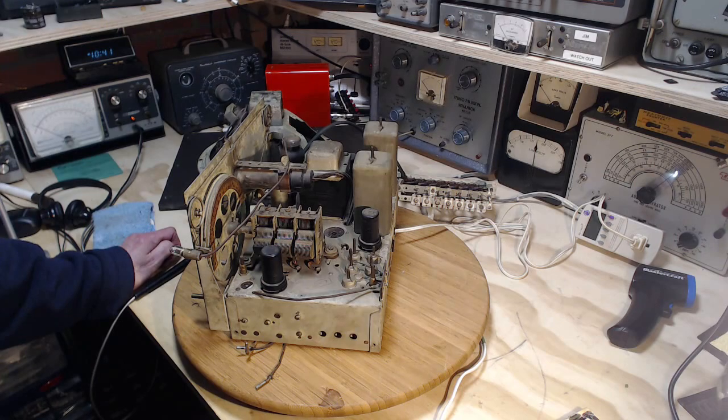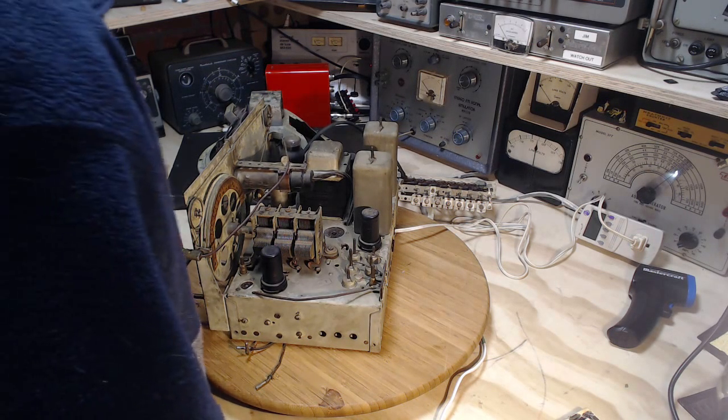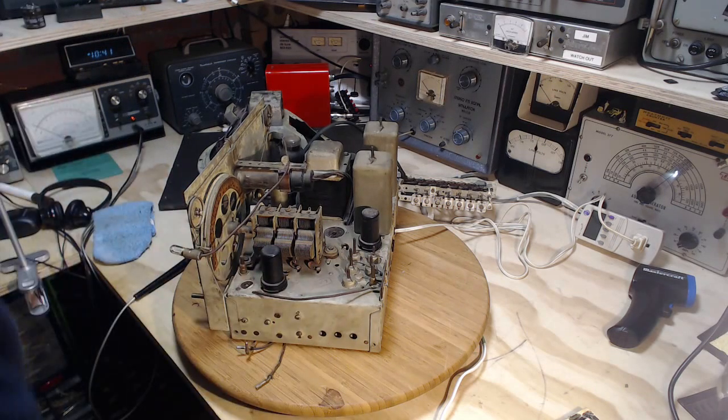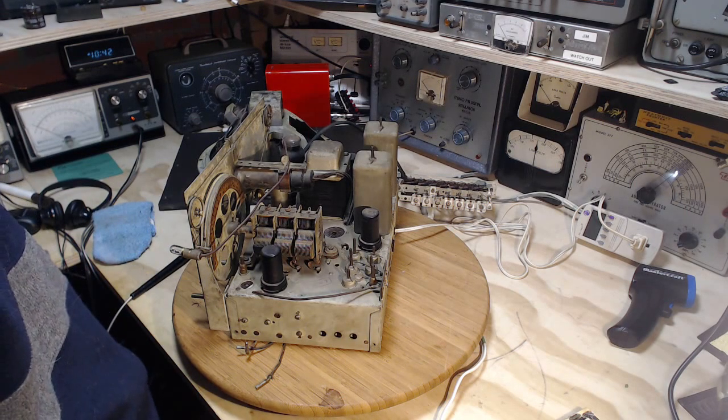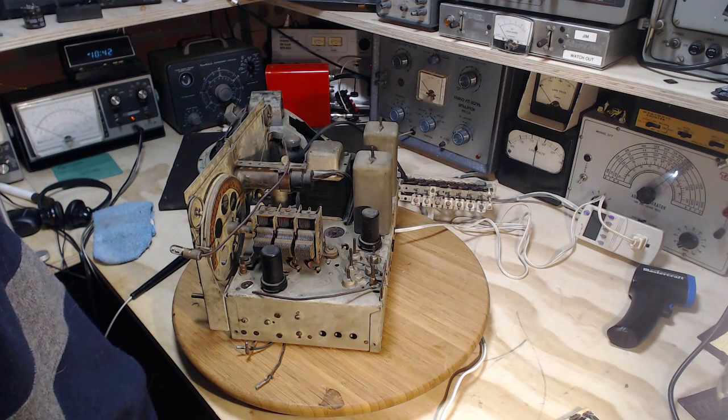Now, didn't I power this guy up with my power supply? Didn't I find the leakage was like a milliamp or two? A milliamp at a couple hundred volts, it's still not very much power. I don't know, it's not all adding up to me exactly, but I'm quite concerned that the speaker's not making any sound at this point. That, I think, is the focal point. Make the speaker speak.